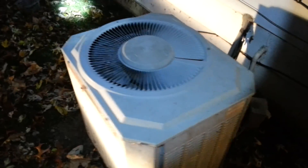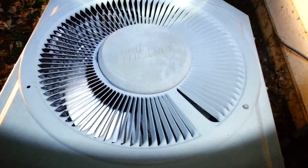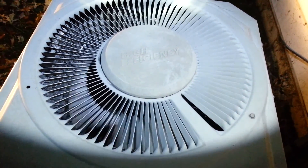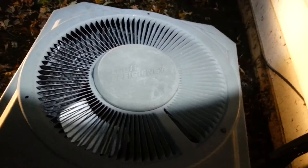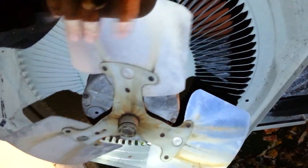It's a cold night and the renter called saying they got no heat, so I came over to investigate this old Trane unit. I'll show you what it's doing. The bearing is out of our fan motor, so I will take this apart and see what we can find out — see if we can fix it and get some heat out of it.